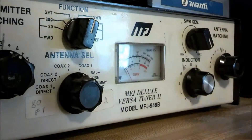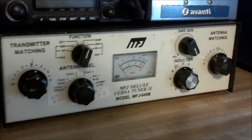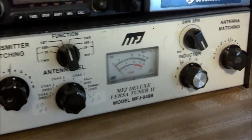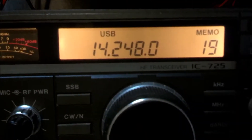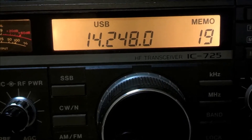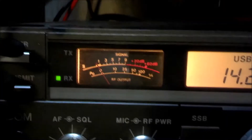The needle drops to zero, so I'm going to turn my power all the way up - and that's a flat match, the needle's not moving. I know now when I transmit, all that power is going out of the antenna and nothing is coming back down into the transceiver. I'll go back to SET, and when I transmit that needle should spike to tell me how much forward power I have going out. Another thing I can always tell is when I've really got a good match to my antenna - when I transmit, you'll see the lights dim on the radio, meaning it's creating as much power as it can. 100 watts going all the way out - we've got a good match.